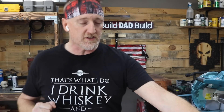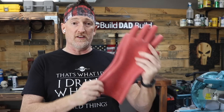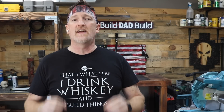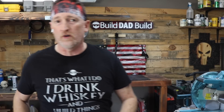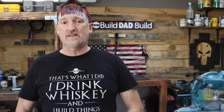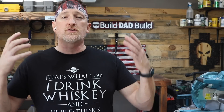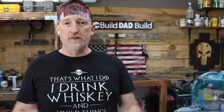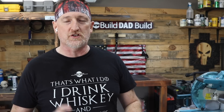Also, if you purchase one of these units, it does come with rubber conductive gloves — this is probably one of the safest ways to handle this. You'll see me using the machine without those gloves, because I do know that I am grounded and my workspace is good to go. One other thing I'd suggest is to keep an eye on metal items. I take my belt off when I do this so my belt buckle doesn't come in contact with anything. You just want to make sure you're not going to arc over to anything metallic. I feel like I've talked for a very long time on safety, but I want you to be very clear that this is not something you should just mess with. Make sure that you know what you're doing before you use this machine.